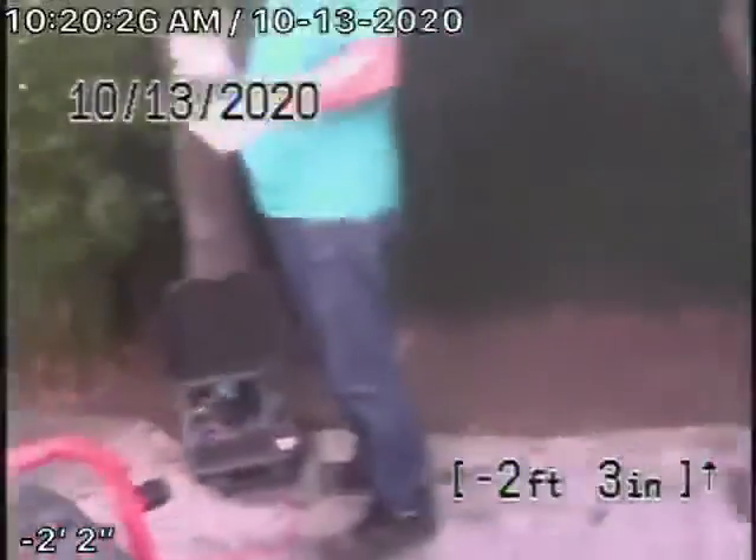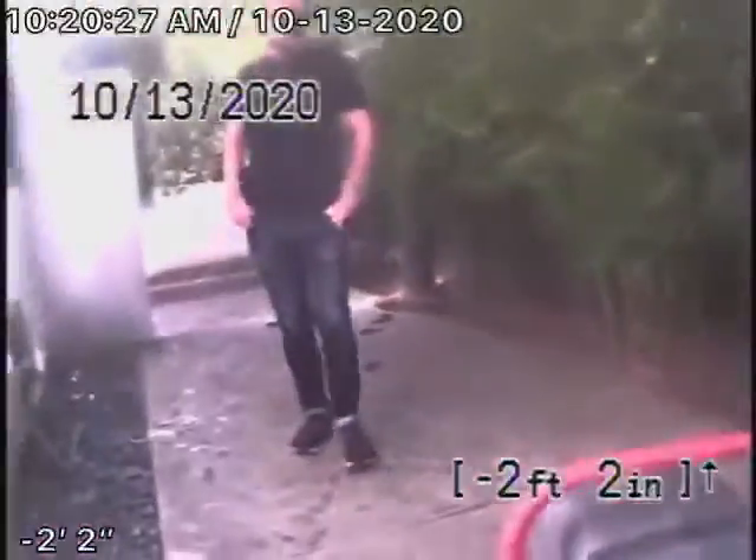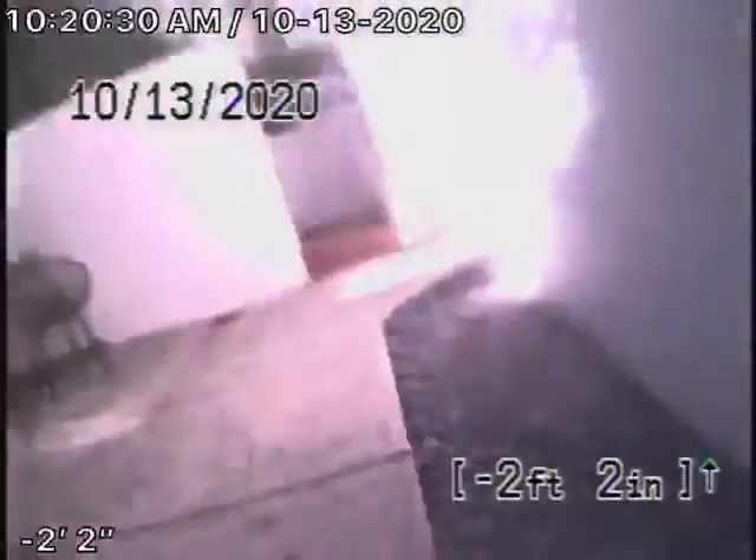It's a short run — a very short run. They're two-way clean-outs; it goes straight into the toilet. We cannot check very much underneath the house over here, but everything is visible. Most of it is ABS plastic with a short section of cast iron underneath there. We're going to run it from the clean-out.